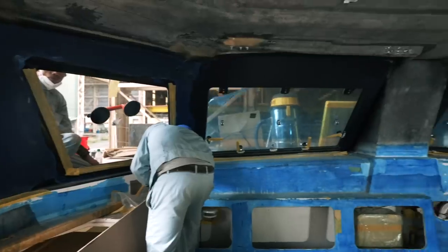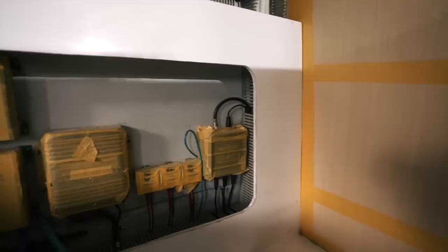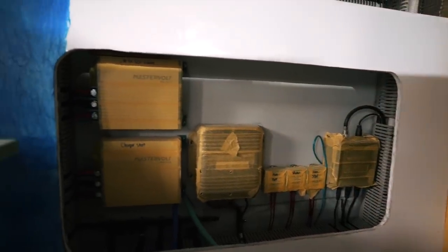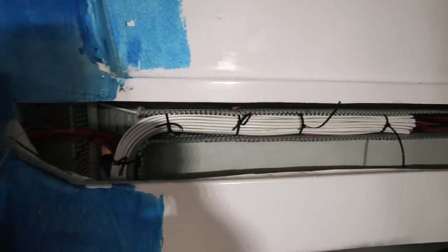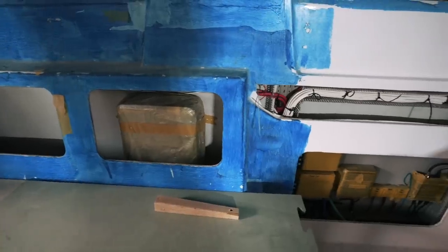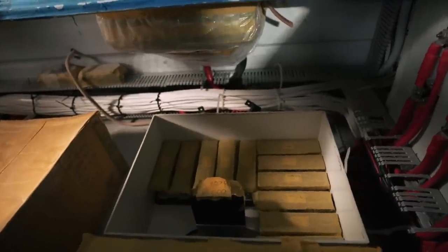This is really important because of Ruby Rose — being able to check the fuses and check the bus bars is something you need to do sometimes very quickly. We've had issues before with things like the windlass fuse dropping out and things tripping. Knowing where all these panels are, where everything is clearly labeled for future maintenance and problem solving with electrical issues — for those of you who watched our episodes in the BVIs, there were some issues with just a straight earth and a tripped switch. This is going to be super useful.